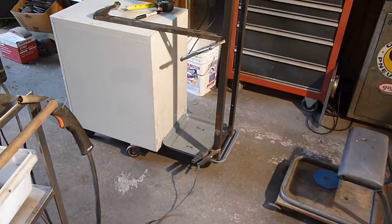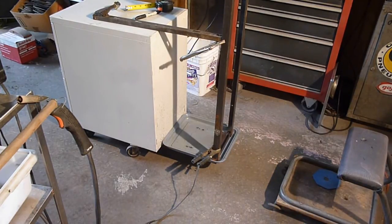Just so you know, I don't know what kind of coatings are on the pan or the bed frame. So if you guys choose to use a bed frame and weld it together — lots of people do it — but if something happens and you guys hurt yourself in any way or, God forbid, end up dead, I'm not responsible. So do your own homework when it comes to coatings and what you think you should be welding. Whatever coating is on this bed, I ground off some of it and some of it I didn't, and it really stunk. It's not just bare metal — there's definitely something on it.